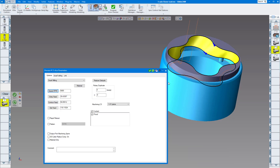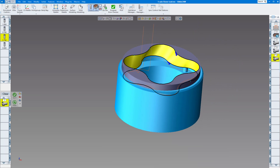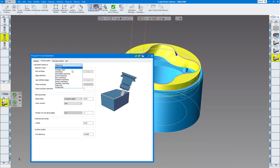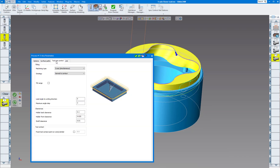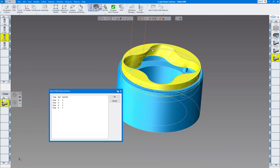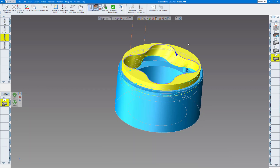The fourth operation is basically the same thing except I'm just taking a finish pass. For the deburring, that's also in Five Axis under the General tab, Surface Paths — click the drop-down and you'll see Deburring. Tool axis is five-axis, and I want the tool to be normal to the contour since we have plenty of room. Click User Defined — when it says 'part surfaces' you have to select the whole body, otherwise you might not get the Do It or Redo button. I have a constant depth of 30 thou; trim doesn't matter here since there are no inside corners. You can give it an overlap and a cut tolerance.